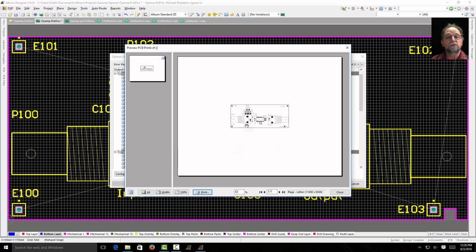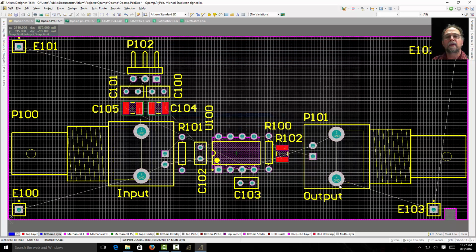This will save you some time and effort, because if you don't do that and the parts don't fit, you're going to send for your board, you're going to spend your money, and you're going to wait your time. It's going to come, you're going to stick it on there, they won't fit, and then you'll think, man, I should have printed it out. It took 2 more minutes, but I should have printed it out. So do your default print, lay your parts on there, and make sure they fit. After that, then you can start routing your copper.